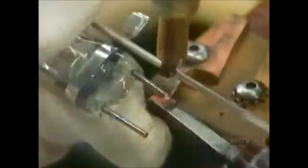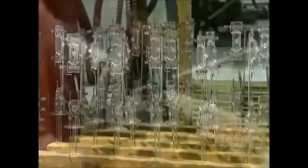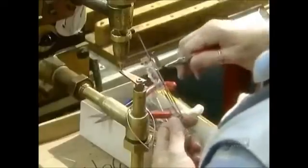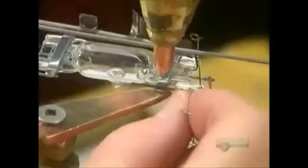Next, they build the mount onto which several other parts will be assembled. They weld on the arc tube — a quartz tube containing a coil, electrodes, gas, and mercury. Next they weld on the bi-metal switch, which cuts the current to the coil in the arc tube. Then they weld on the coil support they prepared earlier.